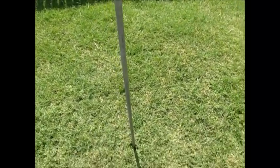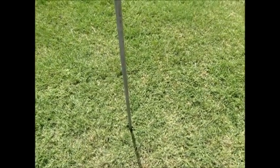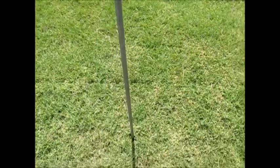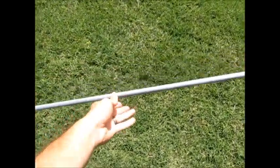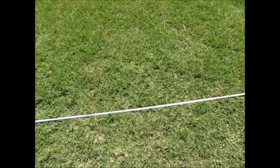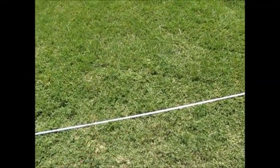It takes a few minutes — about 10 to 15 minutes — to bore a hole down eight feet deep for the typical copper grounding rod. This is a heck of a lot easier than pounding it in. Plus, I've read that pounding it in with a mallet or a sledgehammer will remove the copper coating off of the ground rod and make it basically useless.